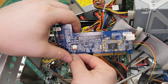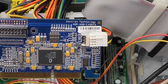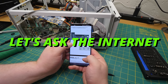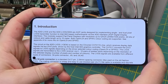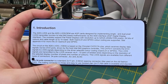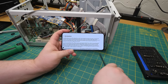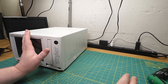AGP does not require the OS to actually have a driver loaded for the device to function. Because it's DMA capable, I'm pretty sure this chip can just sit there in the AGP slot and periodically tell the system 'give me the contents of memory at this address', then convert it to LVDS RGB triplets and spit it out the port. That's why we didn't see any sort of driver in the operating system to run this thing - I don't think the OS is even aware that this exists. There are so many part numbers on this thing that I'm pretty sure we'll be able to look up one of them. This appears to be made by Contron. It's called AGP ADD LVDS TX.